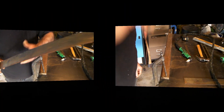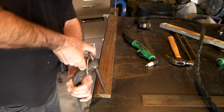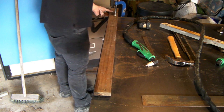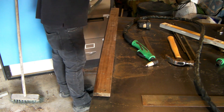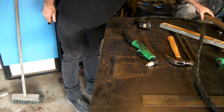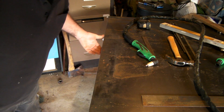Just when you're getting a little bit jerky it doesn't cut completely through, but it's not a bad cut all in all. You can see this other end — see how it's getting a little bit jerky? That's entirely because my movement changed; it got jerky rather than constant and smooth like the front end. It's an art — plasma cutting is an art. We'll take the clamps off and see what we're left with. There you go, that's not too bad — reasonably straight.